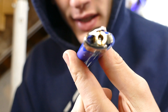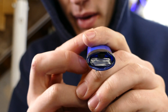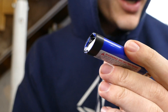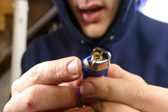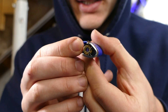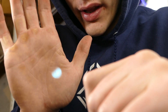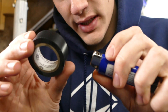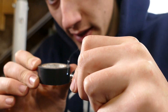Here's the laser lighter. As you can see, we've got the laser diode packed down in there, and in the bottom we've got the 3.7 volt lithium ion battery along with two prongs we're going to use to charge the battery — I made a little charging circuit so one is positive, one is negative, plug that in and it charges the battery. Up here we have a push button switch to activate the laser. If I shine it at the camera it won't do much because at this distance the beam is so dispersed — I can shine on my hand from here and it's just a circle — but if we bring it in closer, about one inch away, I'll show you on some electrical tape: the beam goes from a wide circle, focuses down, and then it'll start burning right about there.